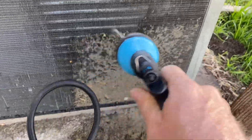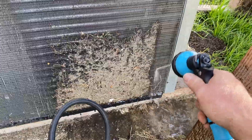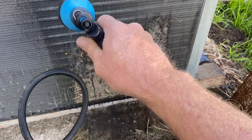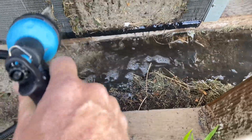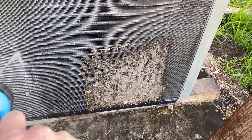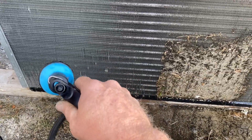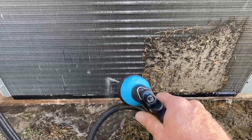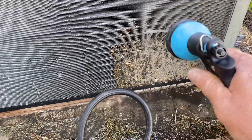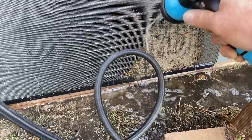You got no spigot, you got no water around, or you don't even have enough hoses on the truck to reach the unit. Watch this — we're washing coils. What we're doing here is adding to efficiency and saving the compressor from dying. We're going to make this unit run so good. The inside coil is iced up, which is real common on refrigeration or air conditioning calls, and you can use this same washer to melt ice off an evaporator coil. I'm going to show you that also.